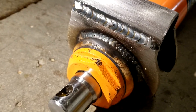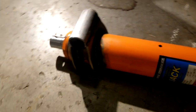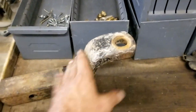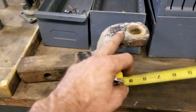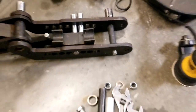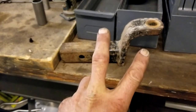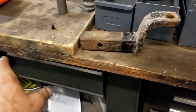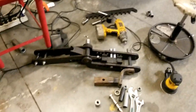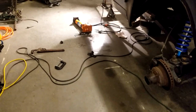There she is, all put back together - tried to get a nice sweet weld on there. It's going to be on there forever. Moving on, I found this old receiver hitch here, and just so happens if we flip it up like that - Mr. Magic Tape Measure here - the distance between the center of that hole and where it blows off the edge is just right to go right here. So I think we're going to make three legs on this: one in the direction that doesn't need load bearing, and then two spread out as don't-tip-me-over feet. This guy can bolt right on there, we'll have our feet come down, hook our ram on it, and we'll be good to go.